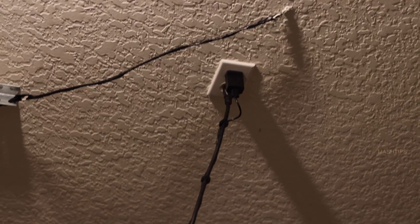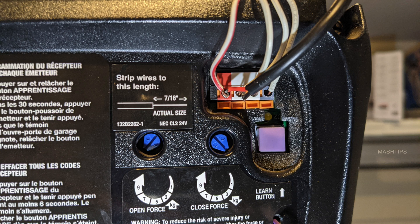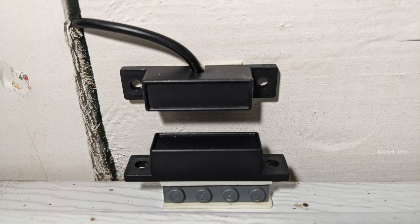I have a wall adapter on the ceiling that I used to connect the power supply for this Meross device. Here is my garage controller pin where you insert the two wires to control the garage. I routed the sensor wire along the ceiling to the middle of my garage door. You can align the reed switch in two different positions. I secured the reed switch and the magnet with double-sided 3M tape on the wall and the garage door.